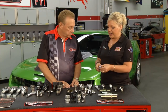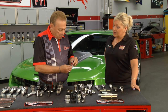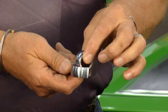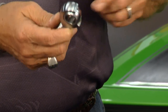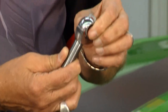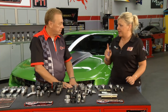What you are really known for — we do a lot of the injection molded race rod ends. Basically, we start with a body that is machined and we cut a slot inside the body. The ball is then loaded into the slot. Once it's in there, we injection mold the red nylon fiber, which is patented for us. It goes all the way around the ball, lubricates it, and there's nowhere for it to come out because it's in a slot. We don't have to worry about dust and dirt getting in there and wearing it out.